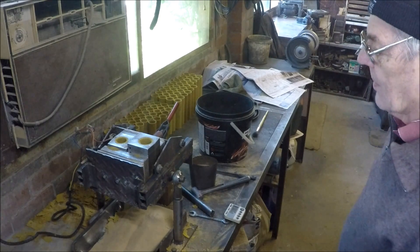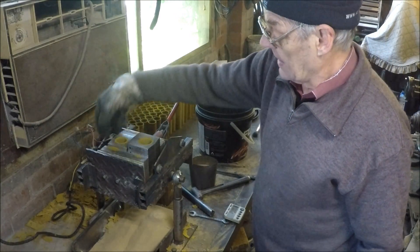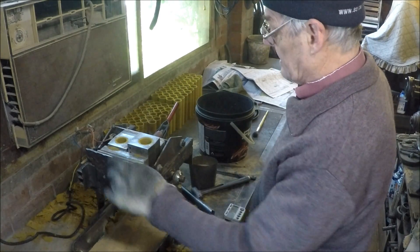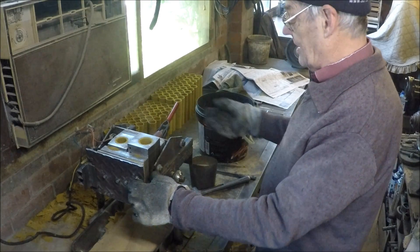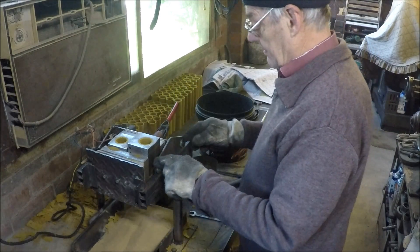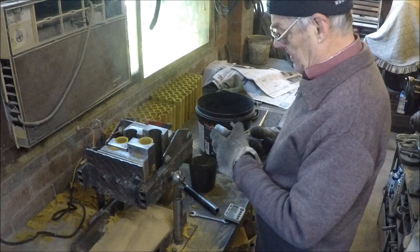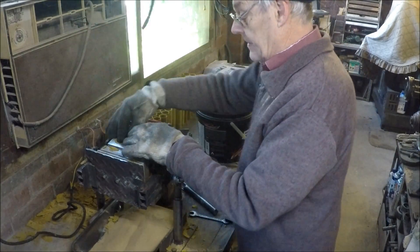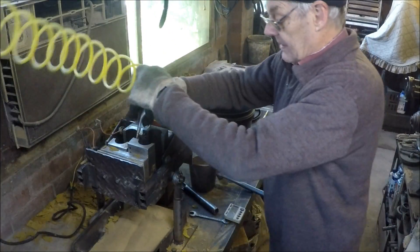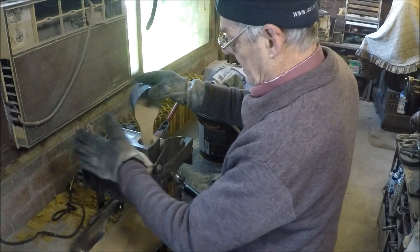This is a slightly more sophisticated way of making the cores. I'm still using the same two electrically heated plates either side of the die, insulated from this crude machine with just a couple of bits of sheet. I've replaced the clumsiness of the G-clamp with an over-centre type clamp, and mounted half of the die on a couple of little wheels so that it all just rattles backwards and forwards - a quick tap and the cores come loose. Get rid of any loose sand lying around.